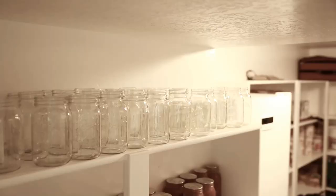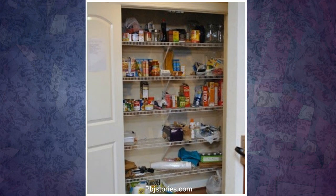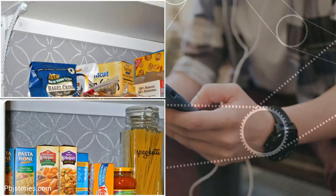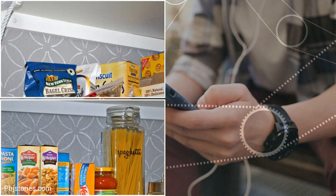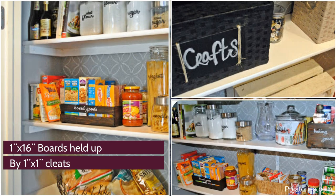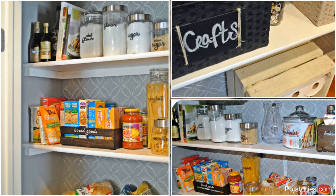Number 4: A Simple Solid Rack Pantry Idea. Sometimes wire shelving won't cut it and you may want to replace it with something more robust. First, remove the old shelves and fill in the holes. It would also be a perfect time to replace the back wall with a more attractive finish. In this case, the owner used stenciling with white overlapping circle patterns on grey paint. For textured walls, applying adhesive spray on the stencil would prevent paint from bleeding out. The shelves are 1-inch by 16-inch boards held up by 1 by 1 cleats. Install decorative brackets in the middle to prevent them from sagging. Finally, caulk and apply fresh coats of white paint to all the pieces.